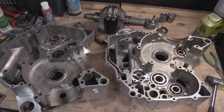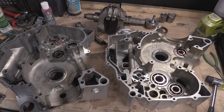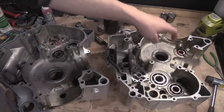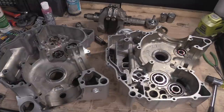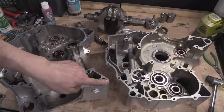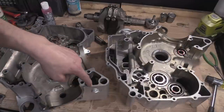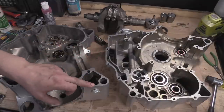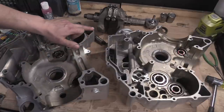The clutch one is straight cut. Usually if there's a helical gear, you'll get a bias of force one way or the other. But anyway, you've got your Permatex goo all over there. Well, we'll get to that when we get to that bit. And then obviously it's putting the goo on. So what we need to do is just do all of the things that we need to do before you get the cases stripped out. So just go around, make sure all these surfaces are nick free. Go around with your finger. If there's any burrs, if anything's dug in, it'll raise two little crater walls, and then you'll have to basically take them off. So you go around giving it the finger.